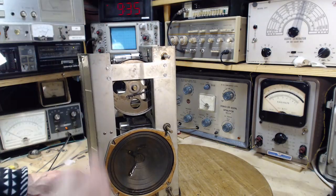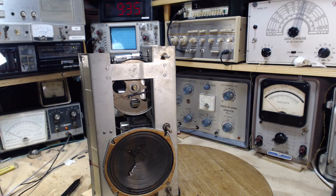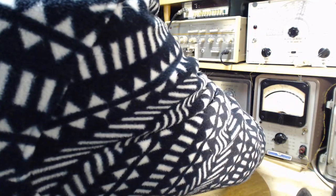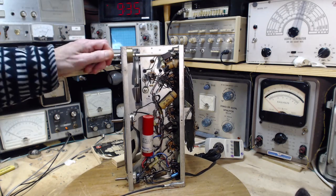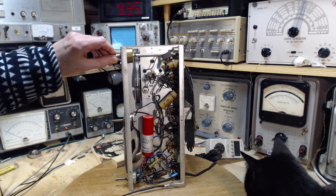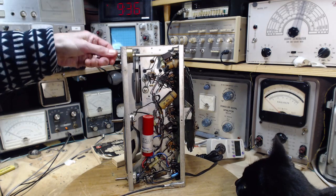So this radio should have a certain kind of tuning feel when you turn this. It should be pretty loose. You should pretty much be able to spin it and let go. Why am I saying that? Because they went through the problem of putting a big weight, putting a mass on here to give this dial some feeling of weight. But all I feel is the resistance of the mechanism up in here. Like it needs some oiling, I think. So I think if this were the way they intended it, you'd be able to spin the knob on this. That's a big thrill, you know, for radio operation. Spinning the knob, spin the knob.